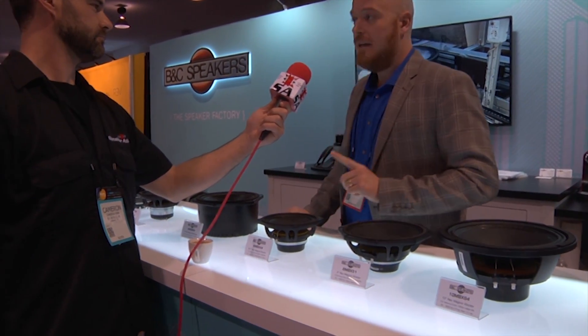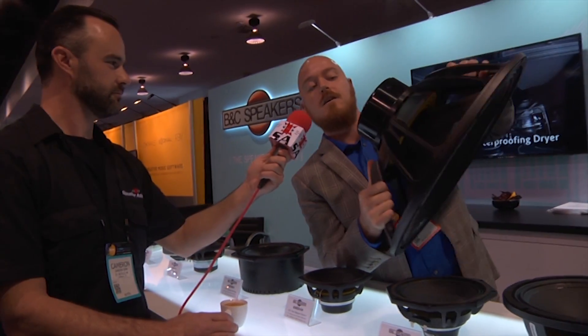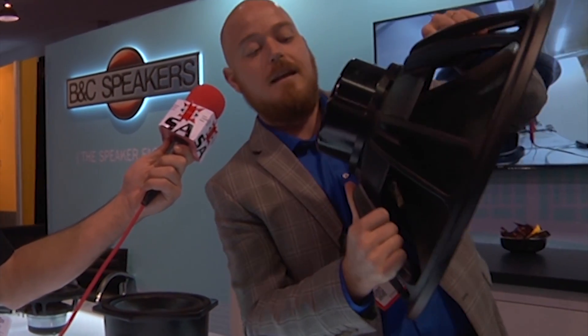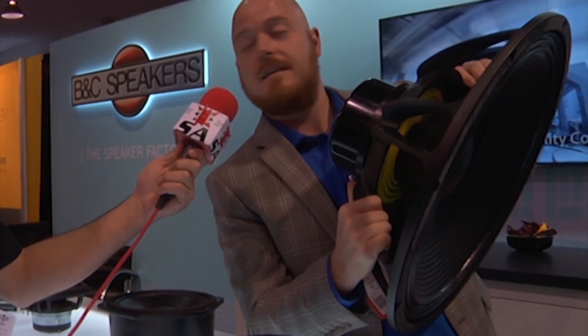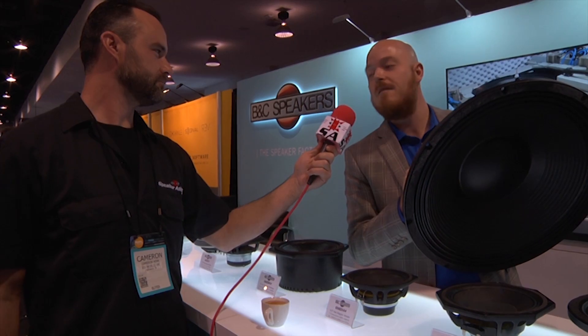What I also wanted to share is we've got a new subwoofer technology that's really exciting. Wow, that is big! It's the world's first 21-inch moving magnet transducer using a new neodymium formed wire technology — drawn neodymium that's wrapped in place around a solid iron former. The result is incredibly high power handling and extremely long excursion. This is going to be the next cinema subwoofer for everybody around the world.